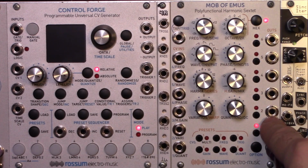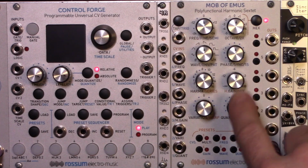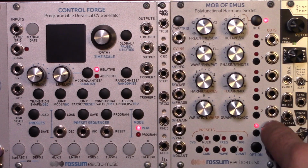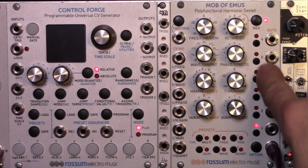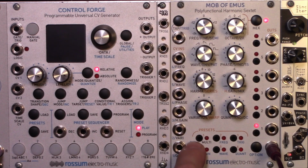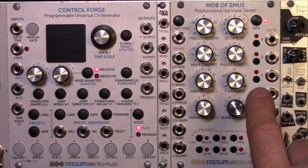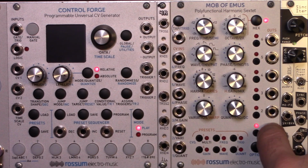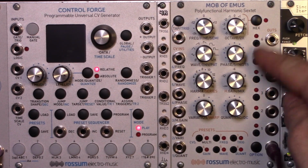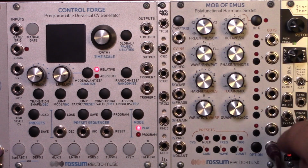Now, the LEDs can also act as a graphical output level viewer, so when editing certain parameters like the harmonic number or, say, the quantization scale, the pot value is displayed as a temporary LED meter. So we get digits 1 through 6, with 7, 8, and 9 wrapping down from the top showing all 4 of those lit, and then the preset 1 LED will light to show the tens digit. Thus, a preset 2 and channel 1 lit would be a digit of 21, and the hex LED denotes a negative value. Also, another graphical cue is when we have no channels selected and turning a knob, we see a little half-second light chase to show us that nothing is selected for editing.